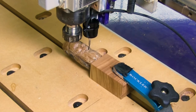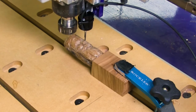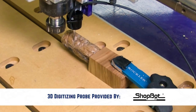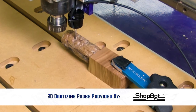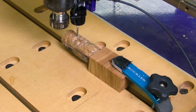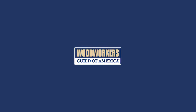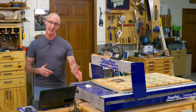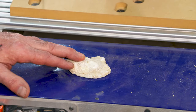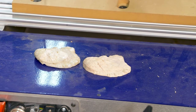I can probe the front, flip it over, probe the back, and then use the CNC to do a two-sided cut and completely replicate this project. To secure this three-dimensional piece, I've got it hot glued to a scrap of wood, and then the scrap of wood is held in place with a clamp. There's really no lateral pressure from that probe, so you don't need a lot of hold-down power. Double face tape easily held that shell in place. That's the shell that I probed.